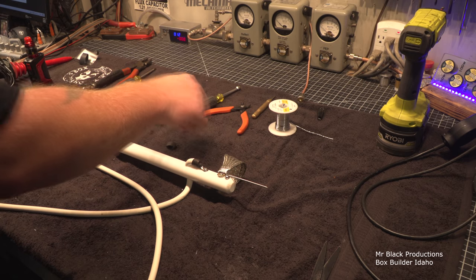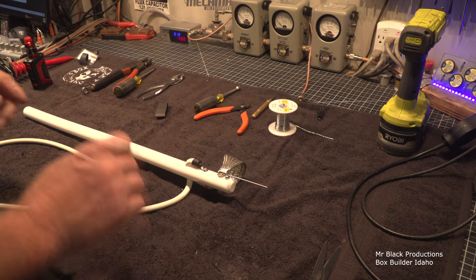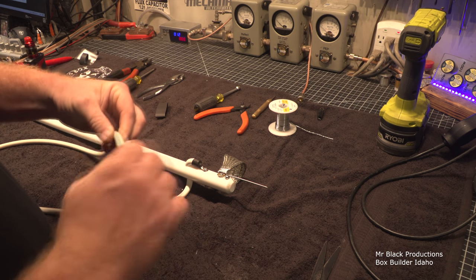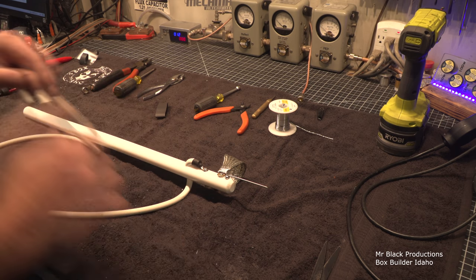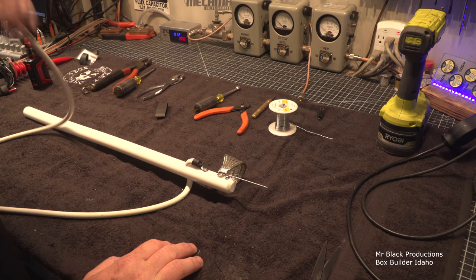The downside with high voltage wire is that it's usually fairly high strand count, but the wire on the inside of it does not bode well to having torque load put on it. So like we can solder that lead on here, and then we twist this three or four times, the wire is going to snap off.